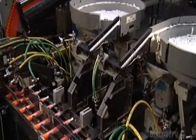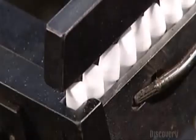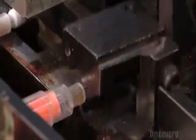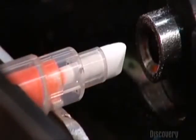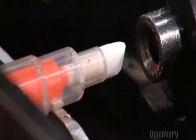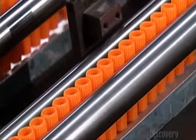A vacuum pump sucks the ink into 6-inch steel needles, and a robotic arm pushes the needles into the polyester reservoirs, injecting them with ink. A combination of mechanical vibrations and compressed air drive a conveyor belt carrying the pen nibs. The nibs fall into the clutch of a mechanical claw, which drops them to a circular pusher. It shoves the nibs onto the pens and they interlock, and the impact floods the reservoir inside the pen with ink. A conveyor then transports caps to a mechanical gripper, and the gripper slides them over the nibs.